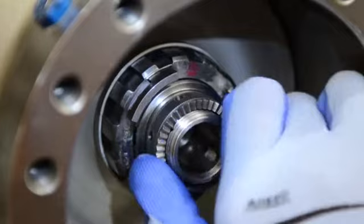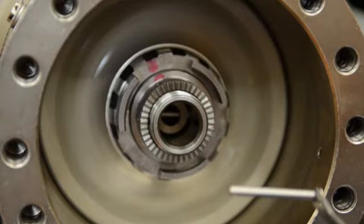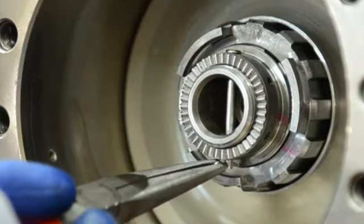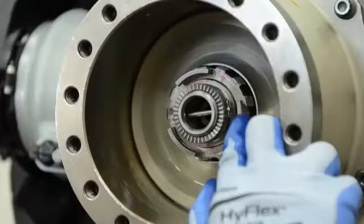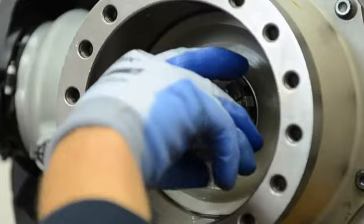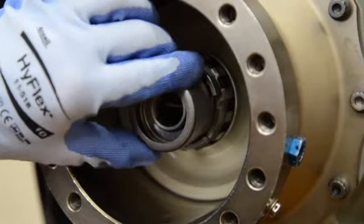Installation of the headed pin is a design-critical characteristic — make sure a second person inspects the installation. Install the headed pin through the adjusting nut and transfer tube slot. Secure the headed pin with a cotter pin. Do not bend the cotter pin more than 90 degrees. Make sure the rivets in the cap assembly do not interfere with the cotter pin. Align the tangs of the cap assembly with the slots of the actuator retaining nut. Push the cap assembly to compress the spring and turn the cap clockwise with sufficient force to lock the cap in the retaining nut slots. Make sure the cap is locked by trying to turn the cap counterclockwise with no axial load on the spring. If the cap is installed properly, it will stay locked.